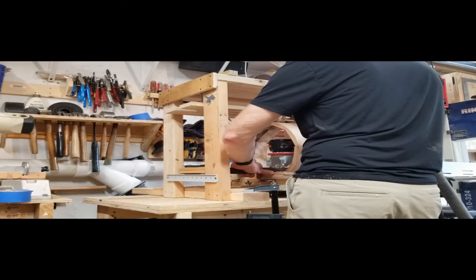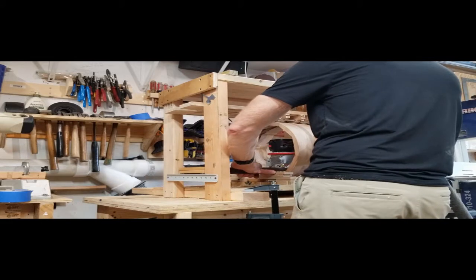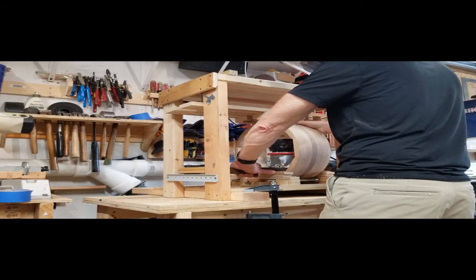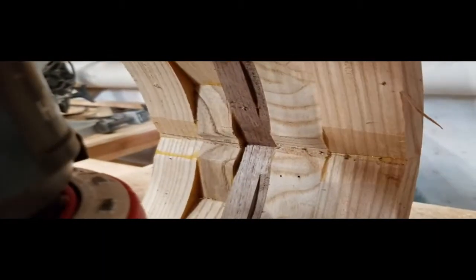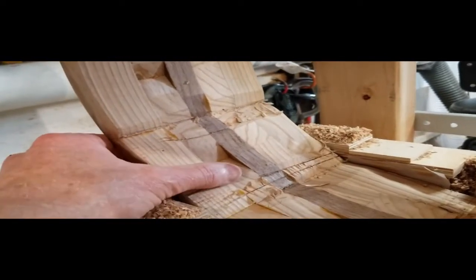Now here I am on the inner milling jig. This jig has been improved a little bit since my oak stave snare drum — you can see on the top I now have brackets with bearings so the shell can't jump out of the bottom guides. You may remember from my other videos that I had some problems with that and got some gouges because the shell wasn't held in well enough. You can see the bit biting into the walnut in the middle particularly, but there are still big deviations in the inside — it's not very round yet.